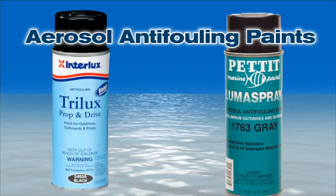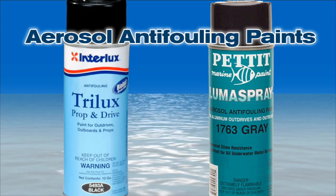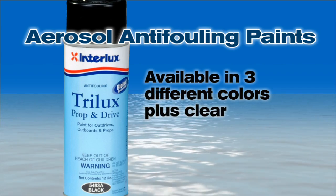Interlux Prop and Drive or Petit Alumispray both offer good protection from fouling, but use different biocides. Alumispray is only available in black, while Prop and Drive is offered in 3 different colors, plus they offer it in clear.